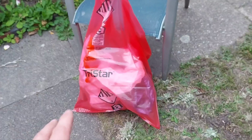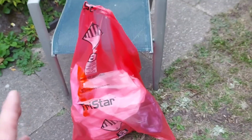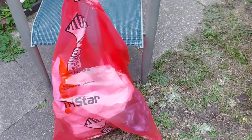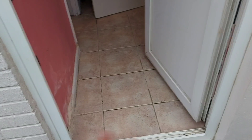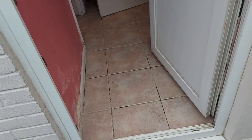I put down the plastic sheet on the ground, so anything that fell down when I was using the tool to get the asbestos out is all now in the bag ready to get binned. I've also put in the jumpsuit, the over-top, and all the PPE. Inside the property, anywhere where the material was — just in case of any specs — the best way to look after it and make sure it doesn't go anywhere else is to make it damp and sweep it all up. I've gone over the whole lot with a wet cloth whilst wearing my mask to make sure it's all clear and ready to go.